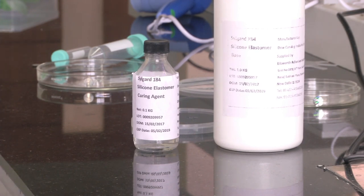Once that mix is ready, we will take it and pour it on a petri dish containing our silicon master. We will have a dish containing the PDMS and curing agent mix with the silicon master at the bottom. That dish we will then keep at around 60 to 70 degrees Celsius for 2 to 3 hours inside the oven. After that, if we take it out, we will see that the PDMS has become cured and has become a solid layer, and we can cut out the PDMS to whatever dimensions we need. This is the overall process we will be showing you today.